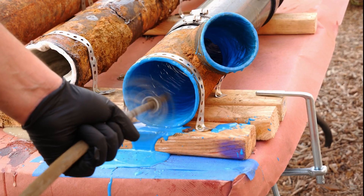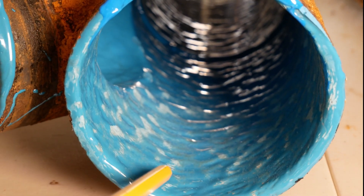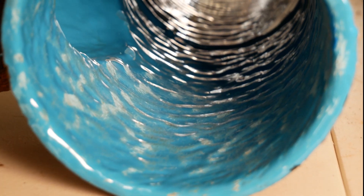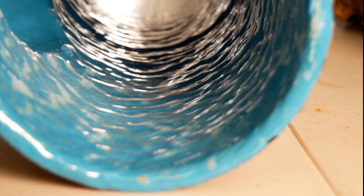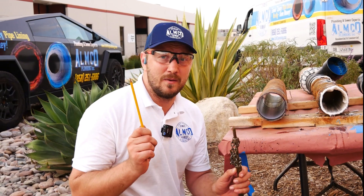We will go inside and see what happened with epoxy — only one layer. We did 20 seconds working with the chain at max speed. It only cut a little bit, but in general it's in pretty good shape. It's really strong, and you can snake it and not worry at all. Are you ready to see the difference between spray epoxy and CIPP epoxy?